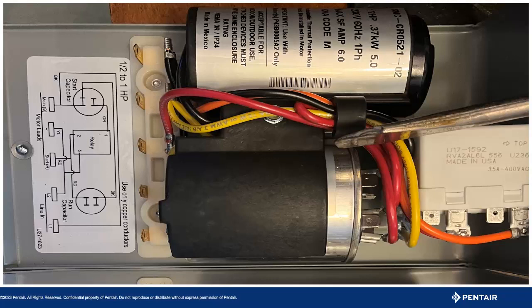Here we see a cap start, cap run control box. It has a start capacitor — these are typically black or dark brown. It is in the circuit only a fraction of a second to start the motor and then falls out of the circuit. The relay, the rectangular box, controls the start function. In a cap run box, the relay switches from start to run function and engages the run capacitor — the metal encased capacitor seen here. The start windings stay engaged because, with the control of the start and run capacitor, they are active but at a lower amp draw — enough amps to keep the rotor engaged and reduce the amp load on the main windings, but not so much that they would be damaged.